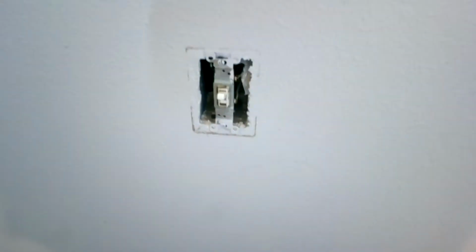We got light switches here. Over here there's a light fixture. Same thing, this is one they want to replace. And actually, the box covered this whole spot. That's why you can see different coloring. And so I will fill in this hole here. Most light fixtures are supposed to mount up here. These wires are hot, but there's a switch that controls them. So I have it turned off and just put the caps back on.